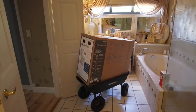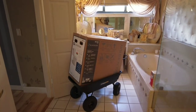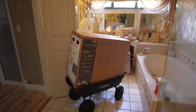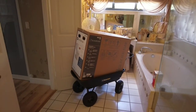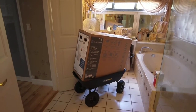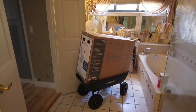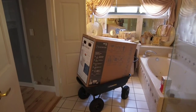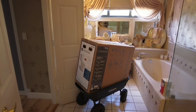Here in South Florida, we don't have to have house traps. As a matter of fact, they don't have house traps, as what I'm used to in the city, in New York City. Therefore, your house is actually acting as a vent for the outside sewer. And of course, you can shove a rag or cover it up temporarily, which I'll have to do at one point. But the least amount of time that I have that open will be better. I won't have to pick up any sewer gases, much less any critters that happen to be nearby that want to take a trip inside.